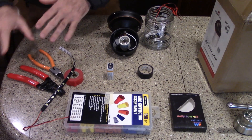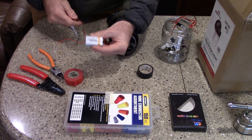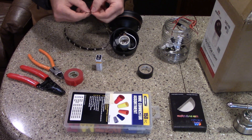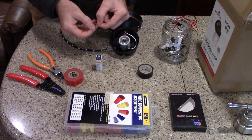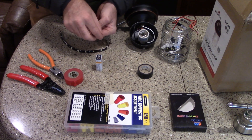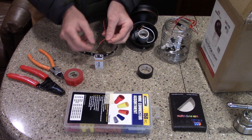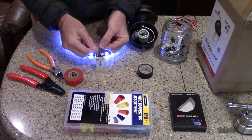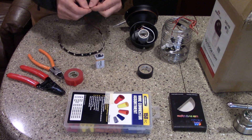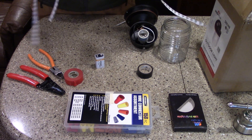Here's a little trick I've learned: you need a 9-volt battery. These are cheap lights and the quality control isn't very good, so I make sure the polarity is right. I've had some of these lights I didn't think worked, then I checked them, reversed the wires, and they worked fine. So I go to the positive side of the 9-volt battery and the negative side — I got light. I do this to every light to make sure it works.